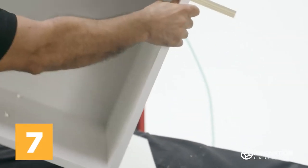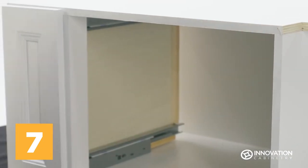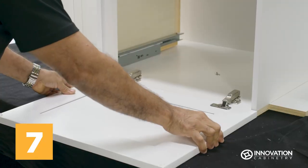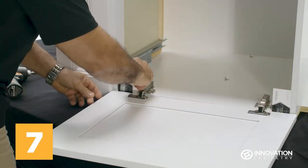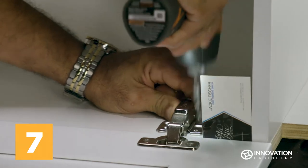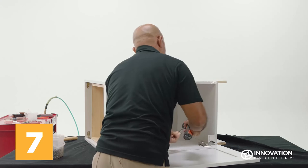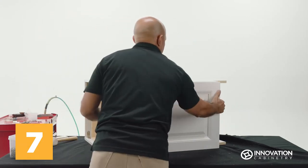Now, again position the unit on its side, open end face toward you. Align the door at the front of the unit and set the hinges flush with the side, keeping a distance about the width of a credit card between the two pieces. Secure the hinges to the side with a drill and prepackaged screws. Check that the door is properly aligned and closes flush with the unit, then stand it upright.